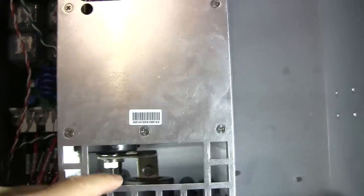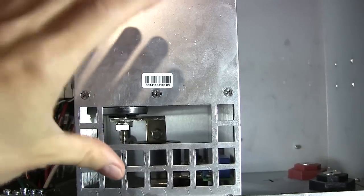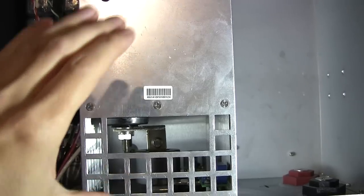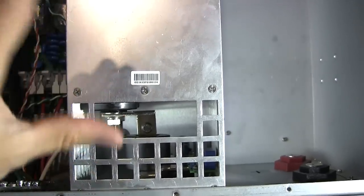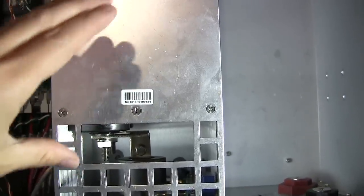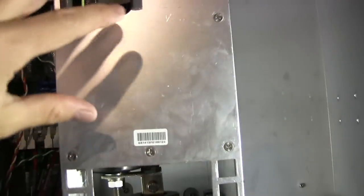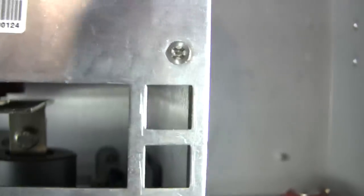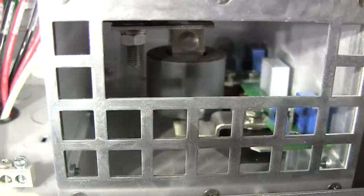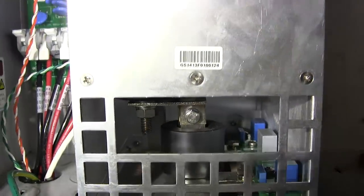I cannot see anything that's blown to my eye on the boards. However, here is the 4000-watt inverter unit inside the casing — these come as 4000 or 8000-watt units. At the bottom you can see the connectors for the battery. I sensed the sound came from there. I've used my nose as well — gone and sniffed around all the electrical parts, and when I put my nose around this area, I can tell the acrid smell is coming from within this casing. I can see the big DC connectors — the black on one side and the red on the other — where the DC connections come in and feed the rest of the inverter circuitry to convert to AC. Unfortunately, I cannot open that unit up without risking warranty issues.